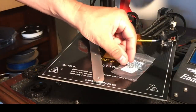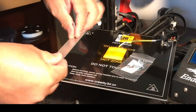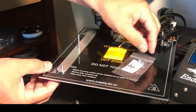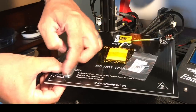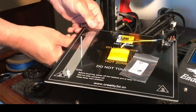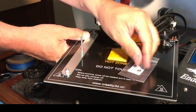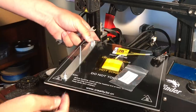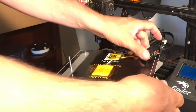These are the extra pieces that come with it. There's a long screw that goes into a bracket, and there's one side where it fits. You place it on top of the bed, it lines up with the holes, and then shorter screws go through the bed into the bracket with a lock washer and nut. You want these tight because they transfer the center position to the outer end — you want this to be one solid piece. I put the lock washer and nut on the back, tightened by hand, then used a Phillips screwdriver and a wrench to get them nice and tight against the bed. That also holds the center screw in place, so I don't have to worry about that slipping.